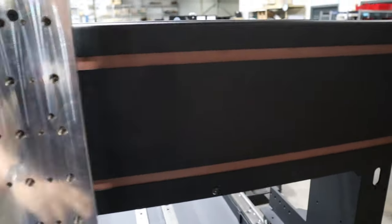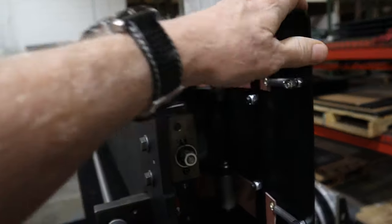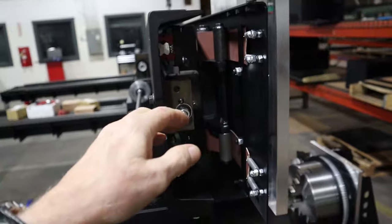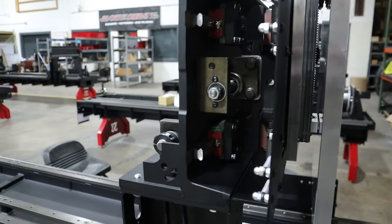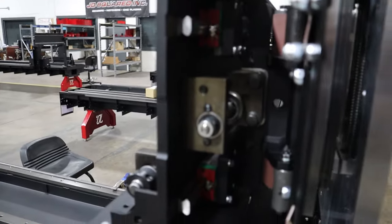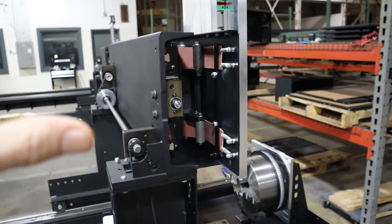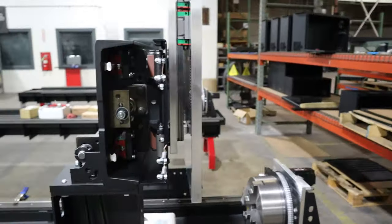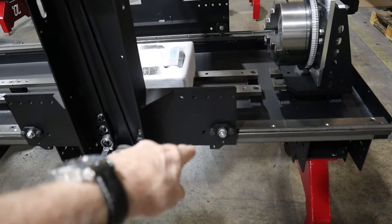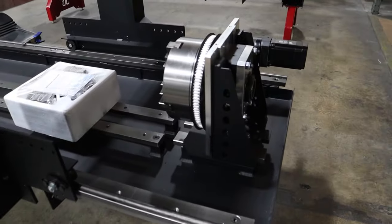Here's a better view of the powerhead — twin linear guides with a 16-millimeter trapezoidal screw, also powered by a Yaskawa servo. On the front we've got a spring-loaded belt tension system that runs through rollers to keep dust off the twin linear guides inside the machine. We also have a large ball screw with scrapers on it. This is a 12-inch piece of channel — very heavy — and all that rigidity is critical for drilling.